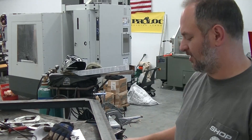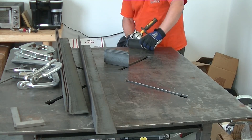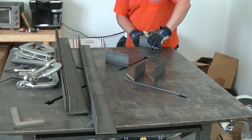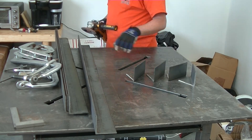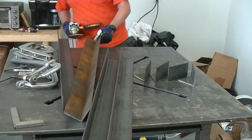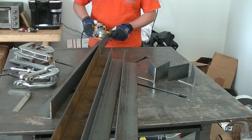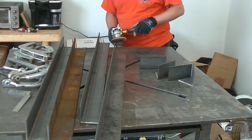Let's take a look at what I've got done so far. We're working with the frame at this point. The outer frame is using 3/16 angle iron, and that's actually kind of pushing the limits of what I can do with my little MIG welder. In order to get both watertight and full penetration welds on this, I went ahead and I'm beveling all the edges and giving myself good, clean, fresh metal to weld into. I'll end up doing two passes — a good root pass and then a cover pass — to make sure everything is going. Lots of grinding, lots of prep work; make sure you get both sides of that done.